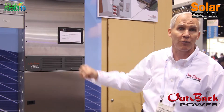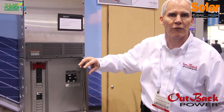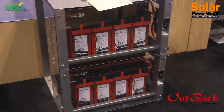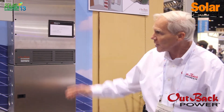Your grid-tied inverter will continue to harvest the energy off your PV. It has a special load center with a motorized breaker, which protects your batteries from being overcharged. We also have a two-shelf rack with batteries which are optimized for a grid-stable or grid-hybrid environment for an AC coupled application — long shelf life, pure lead battery, a long calendar life as well, and it cycles well.